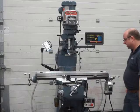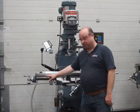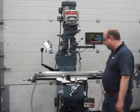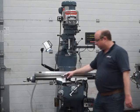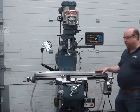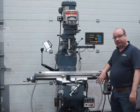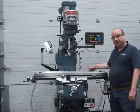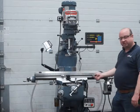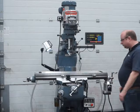it shuts off automatically. Now hidden underneath here are some extra screws to make sure these don't go past a certain point. Now just don't take them off and don't take those out and you'll be fine. Don't try and cheat any extra travel because you'll have an issue. They're there for a reason. They're there to stop the power feed crunching and they're there to stop the scale on the back having an issue as well. So as long as you can move them up and down wherever you want, just don't take them off and don't take those little extra stops out and you'll be absolutely fine.